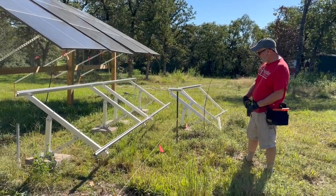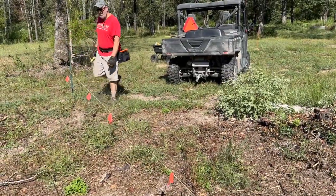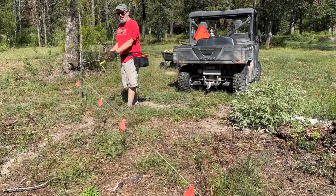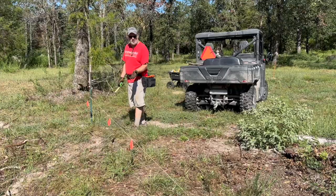Hopefully you confirmed your solar ground mount location before assembling the bright mount kit. I played around with several installation sites — they needed to be somewhere with no shade in all four seasons, so I used the Sunseeker app to check the position of the sun in the southern sky for all seasons. I finally settled on installing them just to the side of my existing solar array. There was no shading evidence except late in the day in the depth of winter, which I can deal with since winter power demand is much lower than summer.